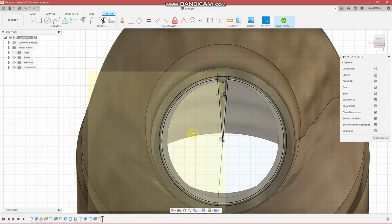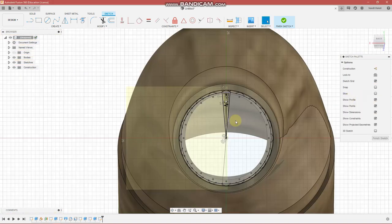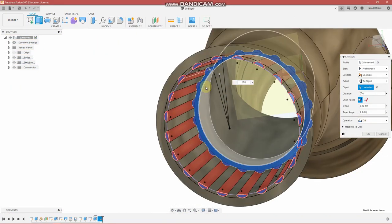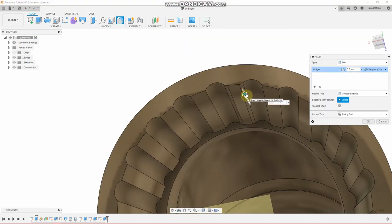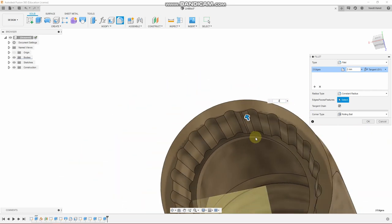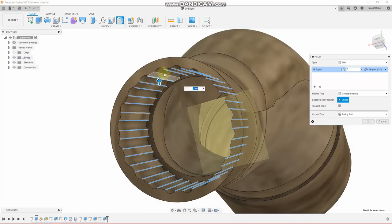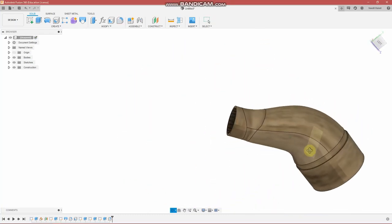Now, I have to admit, this is the second time I'm designing this, so you're going to see a little bit better version here than what was 3D printed. So what I'm going to do is radius these corners here. That will provide a little bit better finish. Rather than a hard stop, hard transition point, it'll be a nice flow, and it should provide a much better 3D printed final product as well.